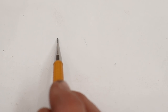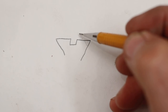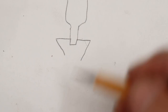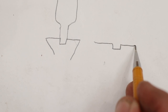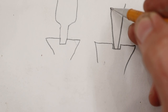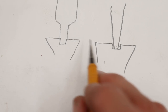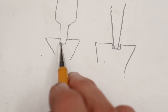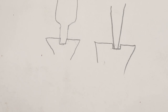Why that's important is, if I can illustrate here, a screw with a slot like this, that hollow ground bit fits perfectly in that slot. Now, if you're using a regular screwdriver in this screw head, the bit would be tapered like so, and there'd be play. Because of that, the screw can cam out or strip out of the screw head. So by using a hollow ground screwdriver bit, you get perfectly purchased in there, which will eliminate that wanting to jump out of the screw head.